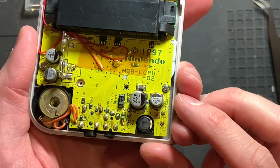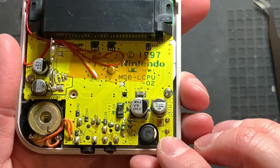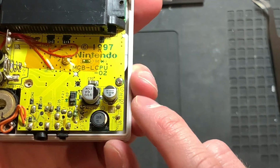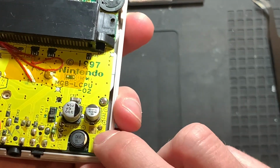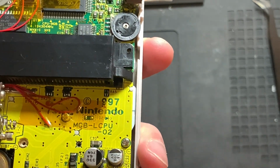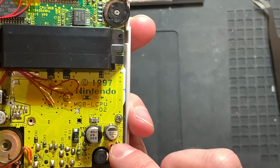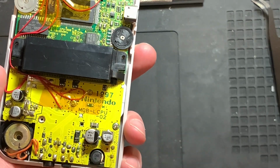So a very quick look. This here is the power regulator. You can't see it from this side. We need to take out the board once more, but it's mounted from the other side, and the new regulator actually comes on here from this side, which is quite interesting. So we will desolder these five pins here, and instead the new regulator board will be put in place, which should fit nicely in here. So let's take out the couple of screws and then desolder the thing.